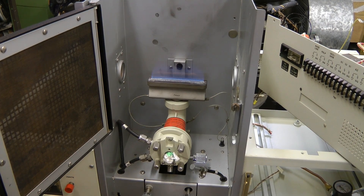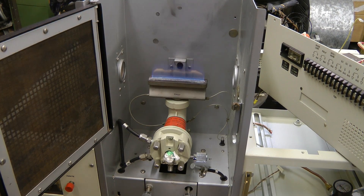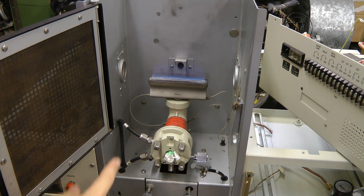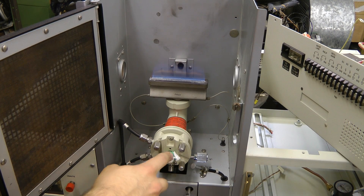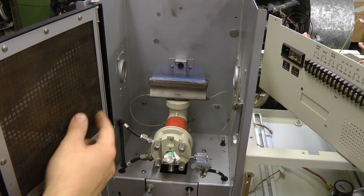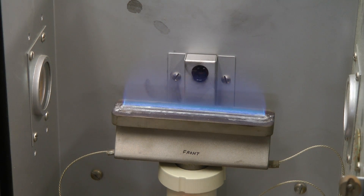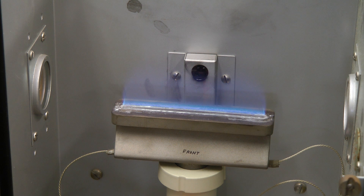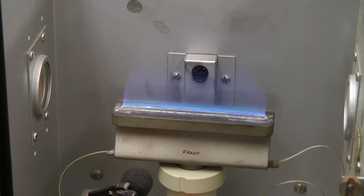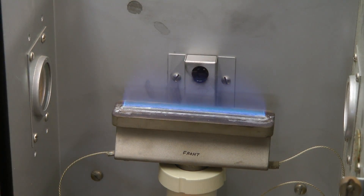Because with acetylene and air, it's extremely volatile. I can imagine these burners would go flying up and hit the ceiling if that fuel were to combust inside. Too bad we don't have the nebulizer — that's the thing that goes in here that mixes the sample with air before injecting it for combustion. Notice some interesting effects if I turn the airflow up too high. Oscillations in the flame.